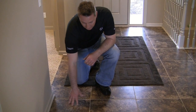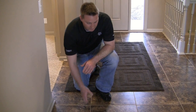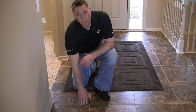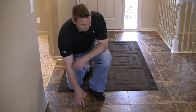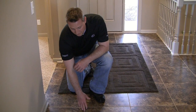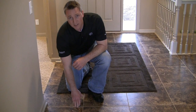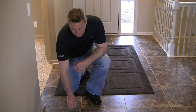The tile itself is a porcelain tile, so it's not going to absorb any dirt or get stained. However, the grout joints will need to be sealed up with a grout sealer. If you add dirt or any kind of liquids with color, that could stain the grout. So the grout joints themselves you'll need to seal, but the tiles themselves do not.